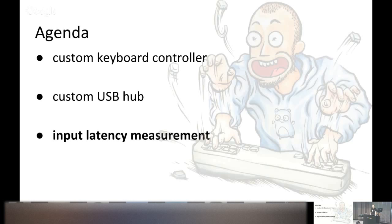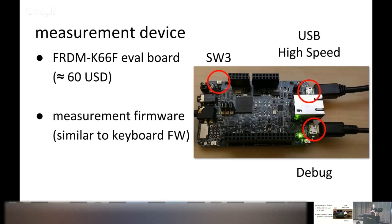To establish a baseline I analyzed what's in the path when using a keyboard with Linux: the USB host controller, Linux kernel with USB driver, and the input subsystem including the input event API (evdev), which transmits key presses from kernel space to user space. I wrote a small program to directly read from evdev, get a key press, and send back the Caps Lock LED as quickly as possible — excluding X11, Wayland, and the graphical stack. You can also verify these numbers using Wireshark, which can capture USB traffic via the usbmon kernel module.